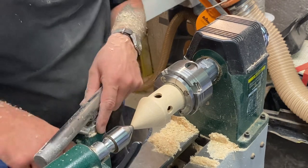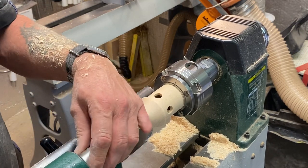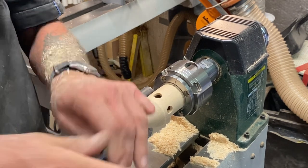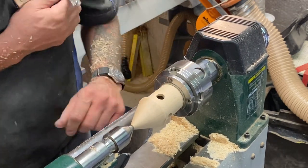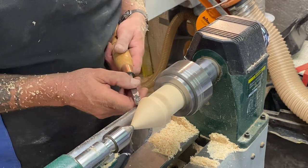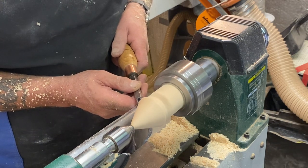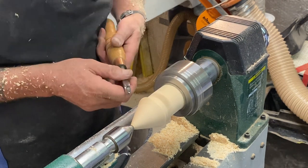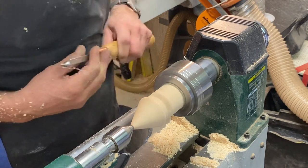Get my tool rest positioned. I think what I'm going to do is wind this back a little bit. That gives me a bit more room with my tool rest so I can get it nice and close, how I like to be — right in as close as I can get. Let's come in here with a detail chisel and undercut this. Be very careful. Rolling it over slightly — when you roll it over, be careful. Watch that side, because if that side's up and it catches the wood, it's going to really give you a nasty catch. You've got to be watching both sides of where you're cutting.